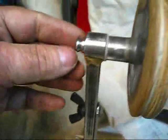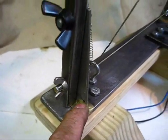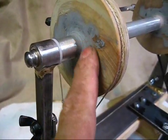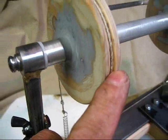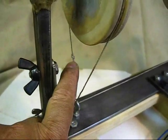This end piece — you remove that in order to remove the bobbin. I'm going to put it on a wood base and I'll have to cut away some material here and round off all the edges. This is just where we're at now. As you can see, I brazed this upright. These two wing nuts remove this upright so you can facilitate removing the bobbin. I have installed the clutch braking mechanism for the bobbin and elected to run it on the outer diameter. For the tensioning mechanism I just chose to put an eye bolt with a spring.